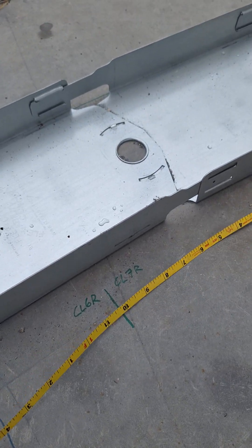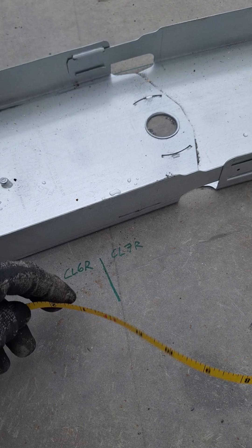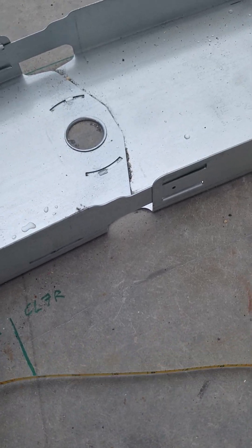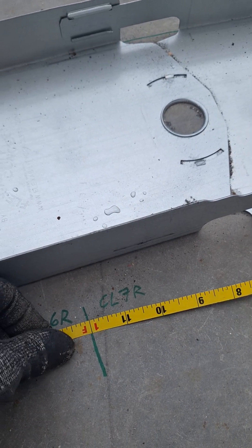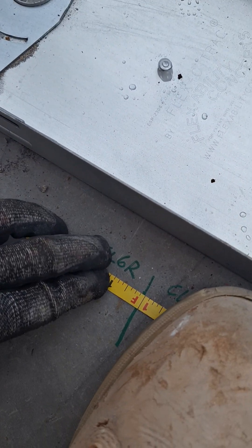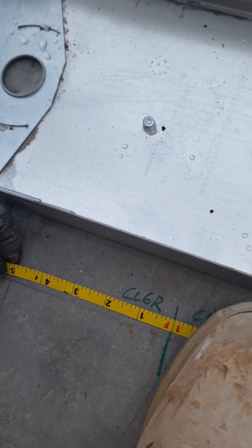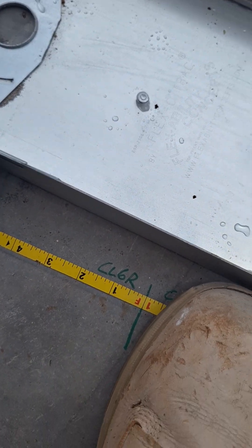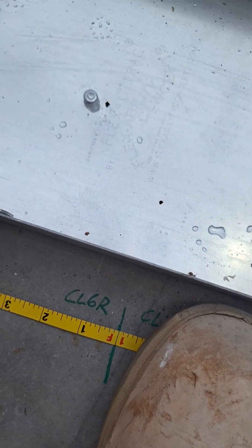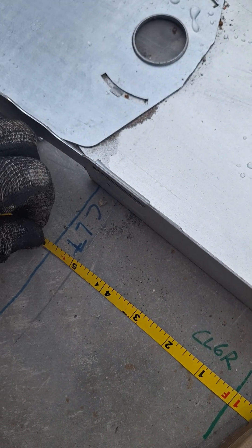But you want to have, if you can, a nice flexible tape. I like to burn myself one foot for my marks, but you'll start here, and our next one is 14'5". You would start right there — I'll do this two-handed once I stop this video — but you would start here and try to get as close to your line as possible, because even the thickness of your tape will change your radius by that much.